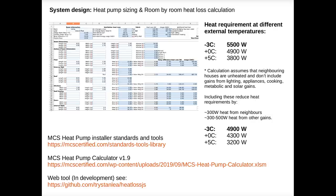My calculation for the heat demand of our house during the coldest hours of the year suggested we would need 5.5 kilowatts of heat, reducing to around 4.9 kilowatts if you account for small internal heat sources such as lighting, appliances, cooking, body heat, and solar gains. Reflecting on our intention to improve building fabric and that we had a backup wood stove for very cold spells, I decided to go with the smallest available Mitsubishi Ecodan — the 5 kilowatt model — rather than a larger model with plenty of spare capacity.